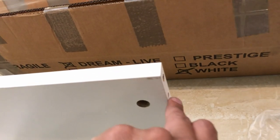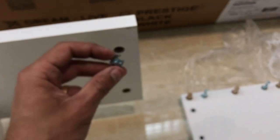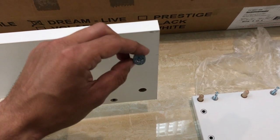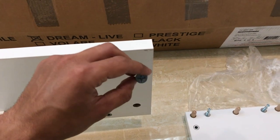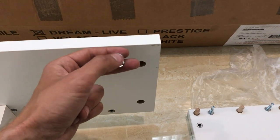What you're trying to do is line up with that hole right there. So you put that in there, and then put this onto this side rail, and then you're going to turn this bolt roughly 45 to 90 degrees. You'll feel it stop, but don't over-turn it, because if you over-turn these, they will break here on this part.